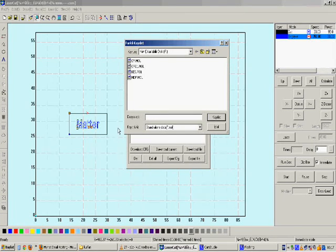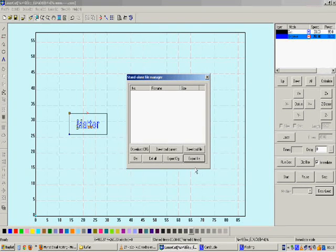If you click on Export File, you will export the cutting and engraving file — namely the rectangle cutting and the script engraving — to the flash memory. Give it a name, for example 'cut'. When you click Save, its extension is also saved to the flash memory. Now we can load both the cutting/engraving file and the configuration file to the laser cutting machine via the flash memory.